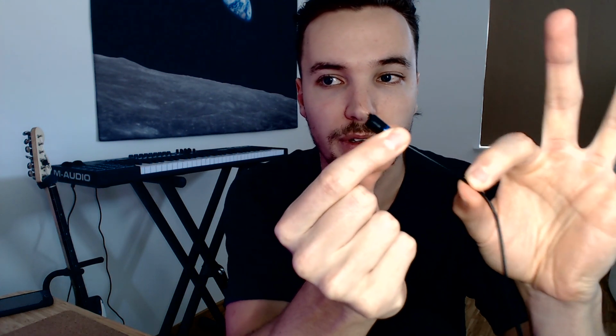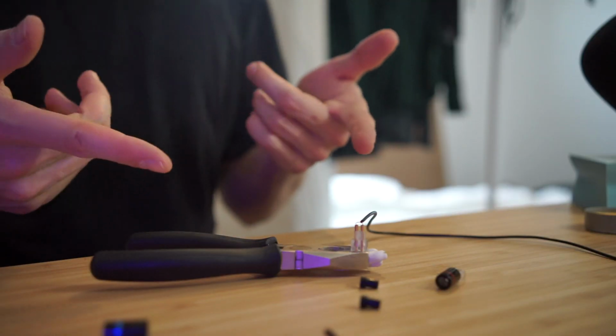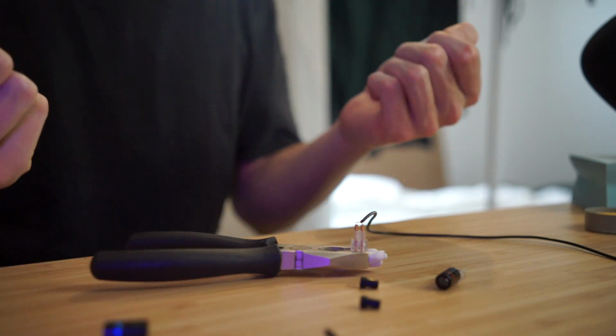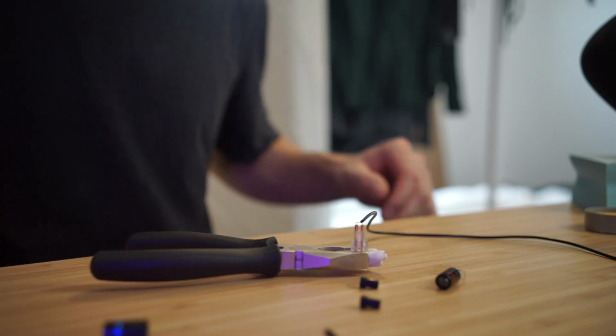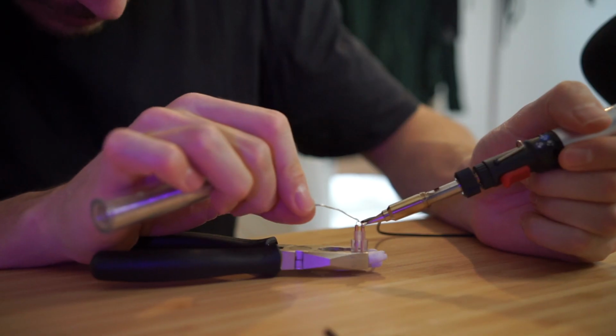So if you watch my next video, you'll hear me talk about how I accidentally pulled off this connector when disassembling the headphones. So a trick to avoid that is just to tie a knot in the end of the cable like this, so that when you slide the connector over there, if you pull the wire, it won't actually come through. So once you've soldered these on, you won't be able to accidentally pull the cable and break the solder joints. Alright, so I've got the wires just sitting in there now, and I'm heating up my soldering iron, and I'm going to drop some solder in there.